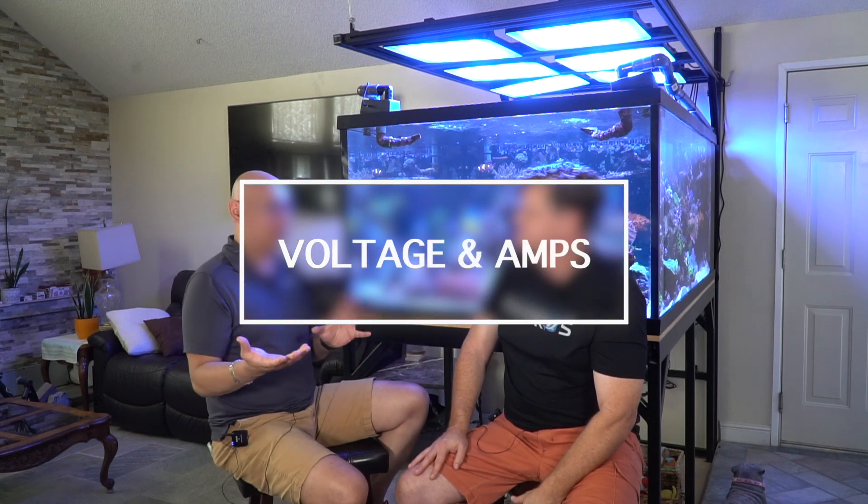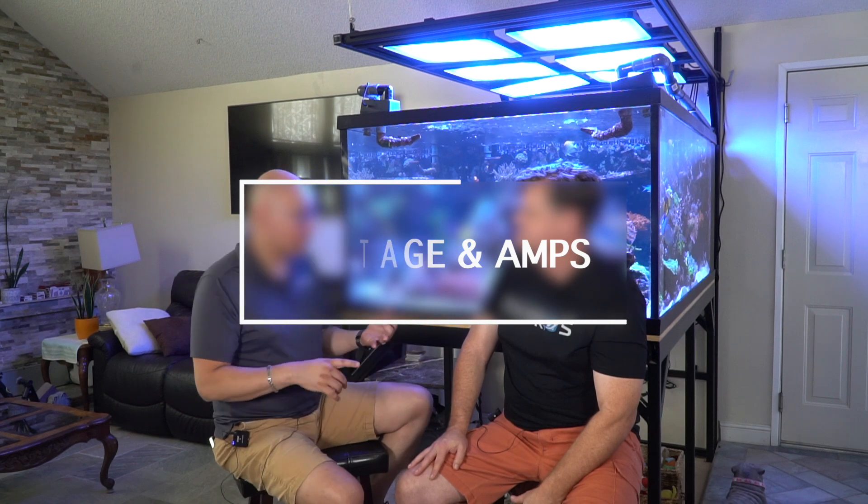Are there any limitations? Electricity is not very black and white — we're talking about 12 volts, 24 volts, and 36 volts, which are very common in the hobby. You cannot connect a 12-volt device to a 24 or 36 — you'll burn it out. You also can't connect 24 to 36 interchangeably without issues. You have to make sure the voltage matches, which you can see printed on the power brick where it says output voltage and amps.